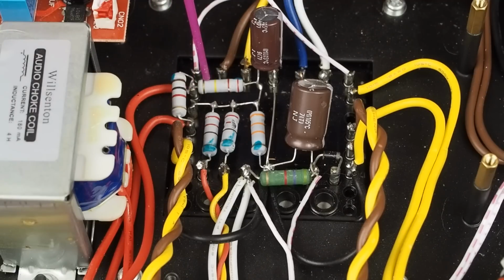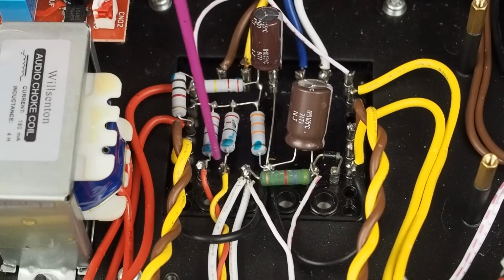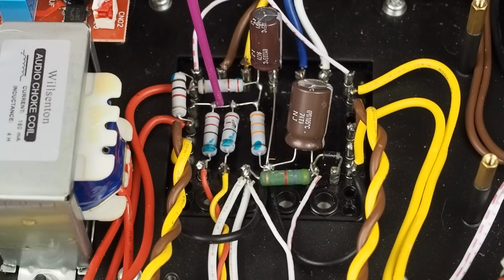And this resistor and this resistor, which is going to ground, and this is high voltage B plus, this is creating a voltage divider that then comes over here, and these 200 ohm resistors are going to the heaters that go to the input or the front section of the amplifier, and this creates a virtual center tap right here between these 2 resistors that then is in the center of this voltage divider to raise up the offset or the heater center tap to be closer to what the voltage is that's going to be on the cathode of some of the input tubes.